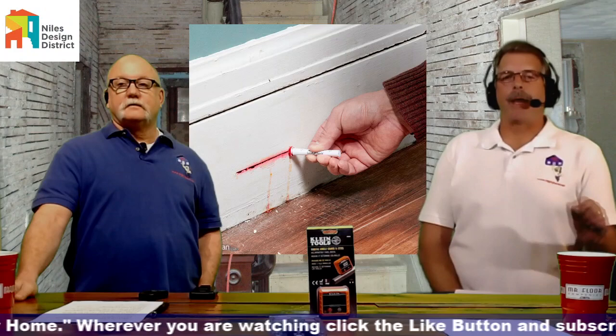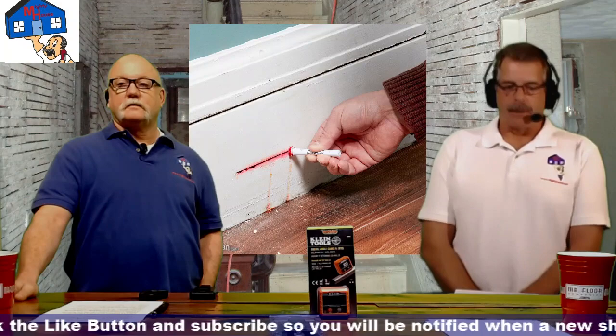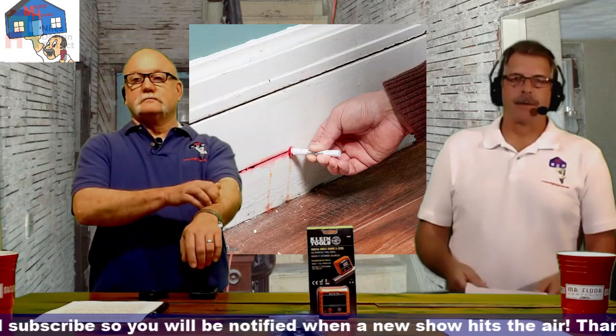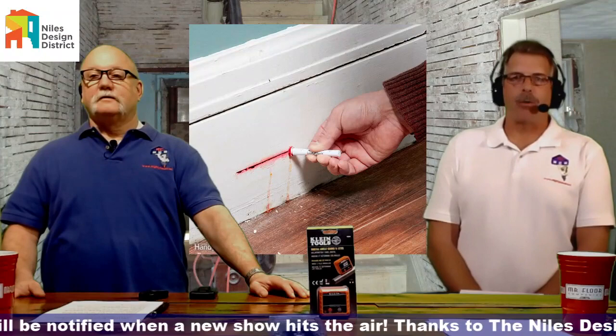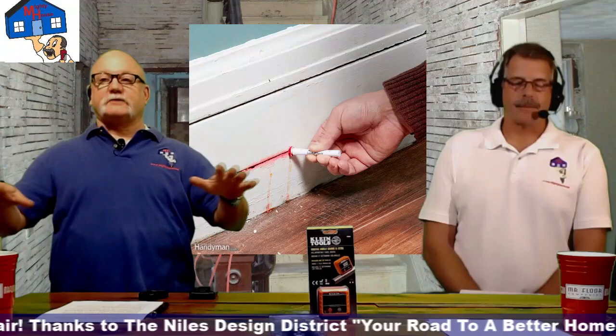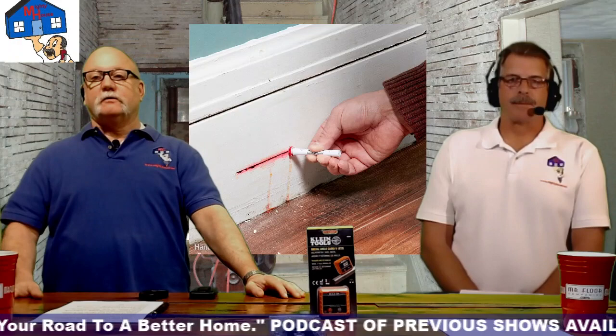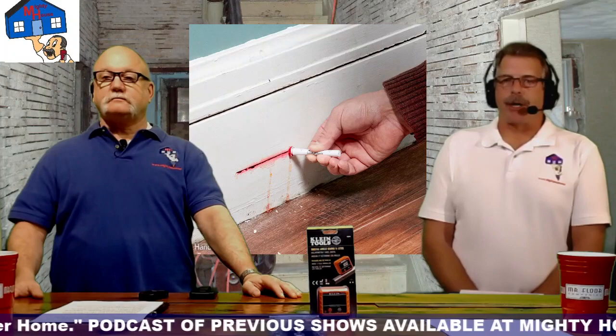What I taught was: don't bother testing. If the house was built in 1978 or earlier, assume lead may be present and follow lead safe work practices. The training got interesting here — even in a newer home, if you're taking out a wall or stripping plaster, a good contractor would cover the floors with tarps, plastic, or ram board, and tape everything off.